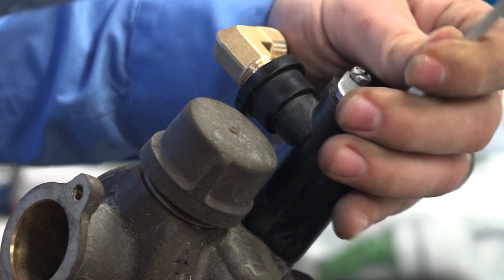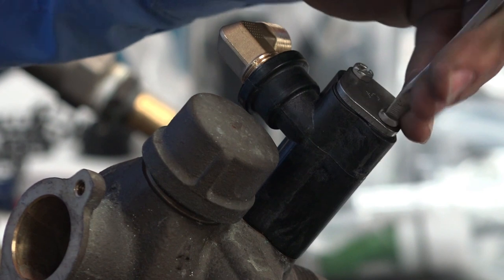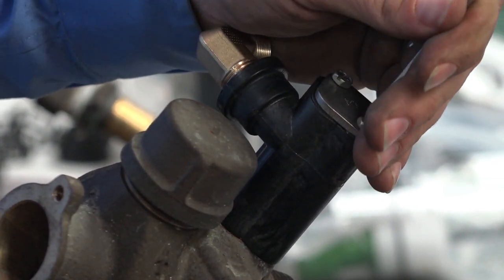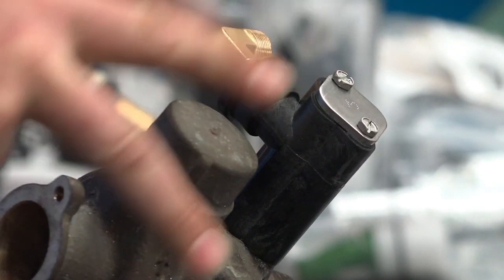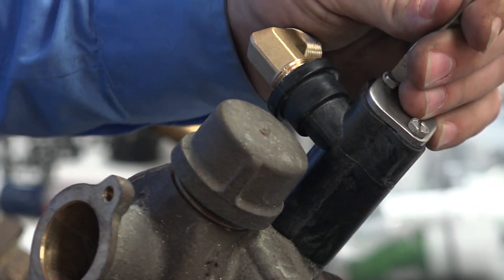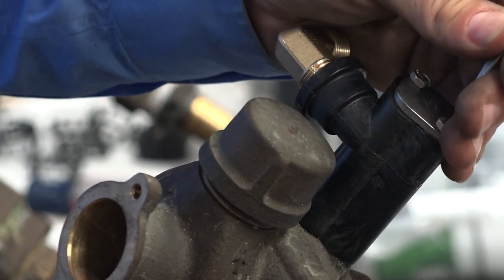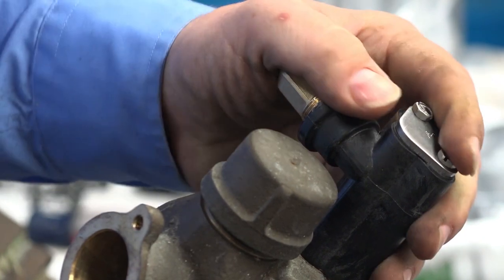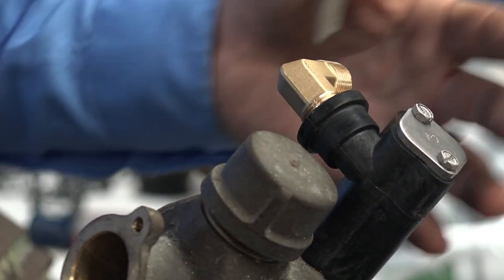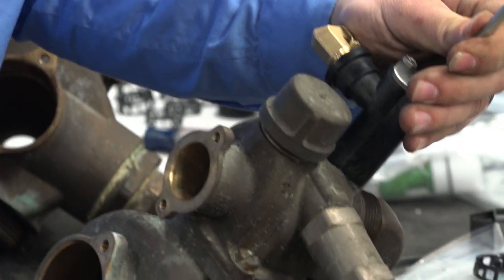One example of that is the seal spacer kit here. There's one extra seal and spacer in it. They must have pulled one for a 2900S, which is the same valve, except it's the one-piece casting. It gets one extra seal and spacer in it. Well, they sent us a kit that has one extra seal and spacer in it. The reason that's problematic is if it's your first time, you're thinking you forgot one, or you're trying to jam an extra one in there. There's just not room for it.